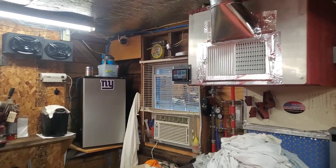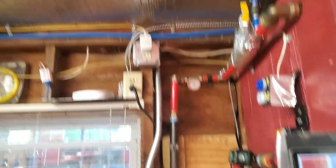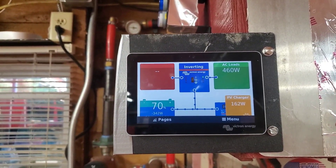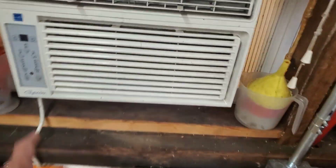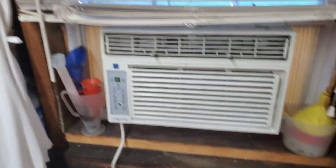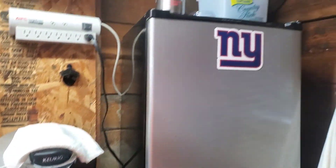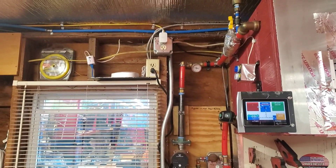All right, we're downstairs — we added a GX50 down here so I can see what everything's doing. Just hit the touch pad. Made a little crooked cut bracket for it, but it works for now. Just like I say, when I run my air conditioner off the inverter, it doesn't swap over to utility power because the transformer swallows up the load. I can run my coffee maker, my fridge, plus we got a couple other outlets down here to be handy. There you go folks, latest upgrades!